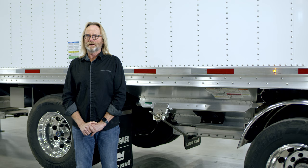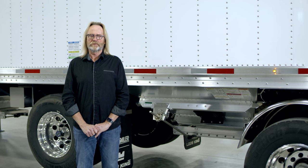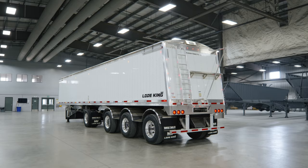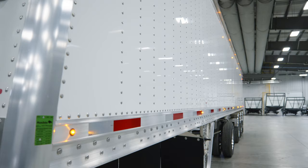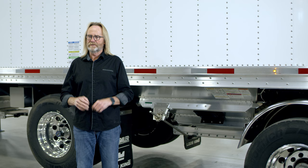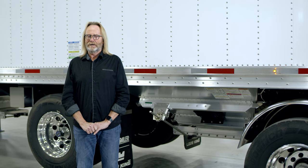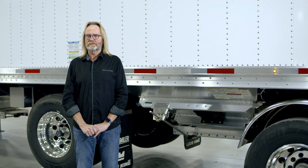Also aluminum means less paint or areas to corrode and rust. In our sidewall construction I mentioned a double-wall construction — you'll notice in the non-load areas there's different spacing where we have our Z-post mounted to the walls. There's eight-inch spacing in the non-load area to make the trailer a little more stiff and robust. In a full load situation, the sidewalls of this trailer have been vented — you'll see vent holes between every Z-post so that any moisture or condensation forming between the two aluminum walls can escape that chamber. The full body of the trailer is also vented — there are vents at the front and rear hood of the trailer giving you venting for the inside of the hopper.